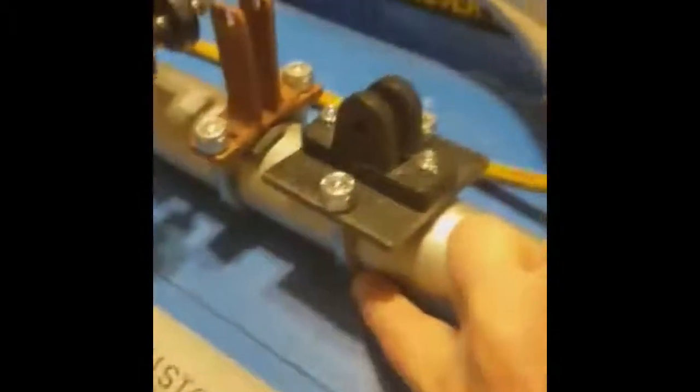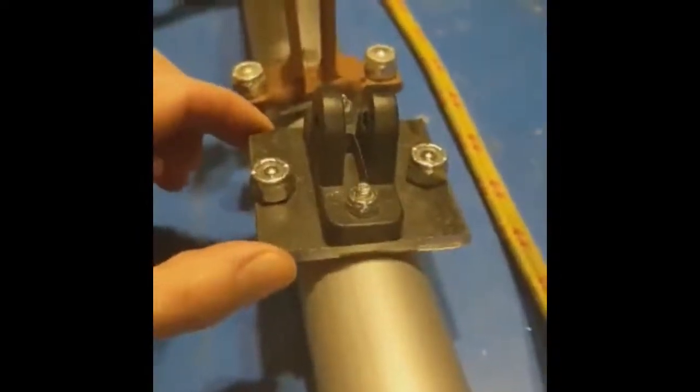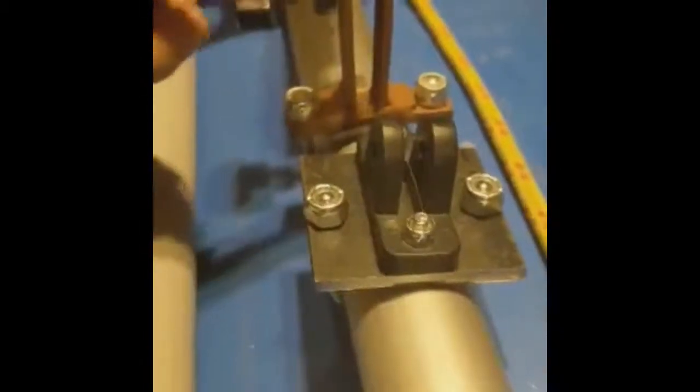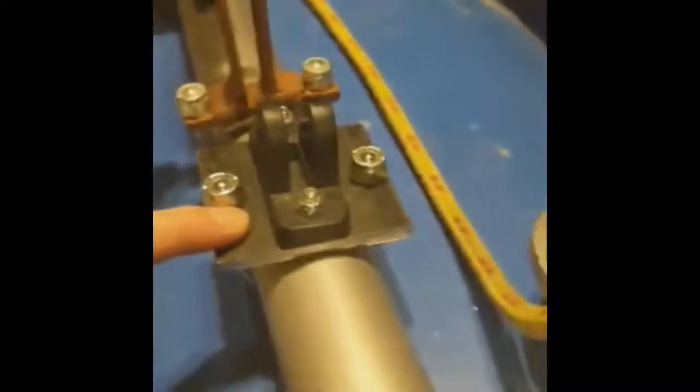And then obviously just the NRS U-bolt. Before we would go out, I would round off these edges and put a coat of primer and paint on here to keep it from rusting. But if you don't want to weld like I did for this one and want to use the parts that came with your bimini, here is a potential solution.